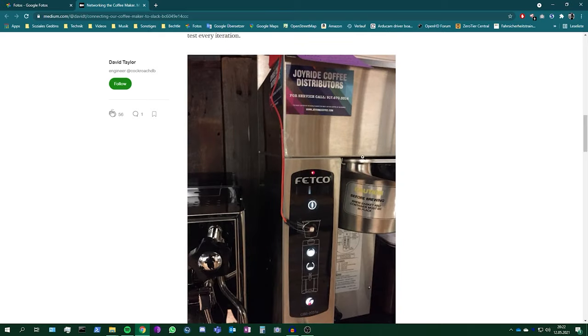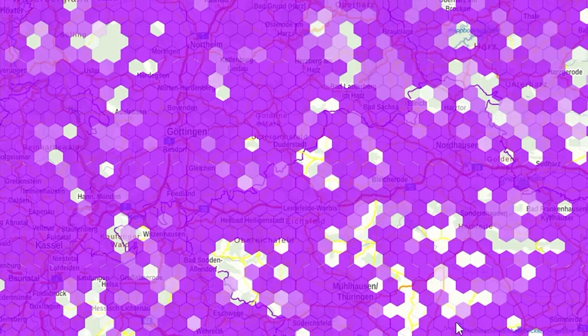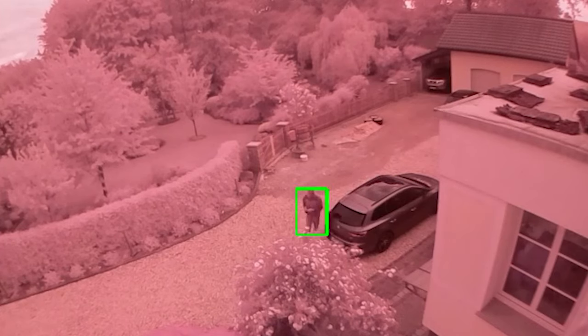The possibilities are basically limitless. This drone can do everything, except make coffee. Well, if you have a coffee machine connected to a network or the internet, the drone might even be able to make you a coffee on a flyby. Both video and telemetry connections can also theoretically be established over the internet, making the drone completely independent of the pilot's position. As long as the drone is unfolded and turned on, it can be controlled from anywhere in the world, assuming you have a fast internet connection and the drone is not in a dead zone, which can be a big issue here in Germany. The video signals from the cameras can also be post-processed by the Raspberry Pi directly to automatically detect objects and control the drone accordingly, or cloud computing can be used for this.